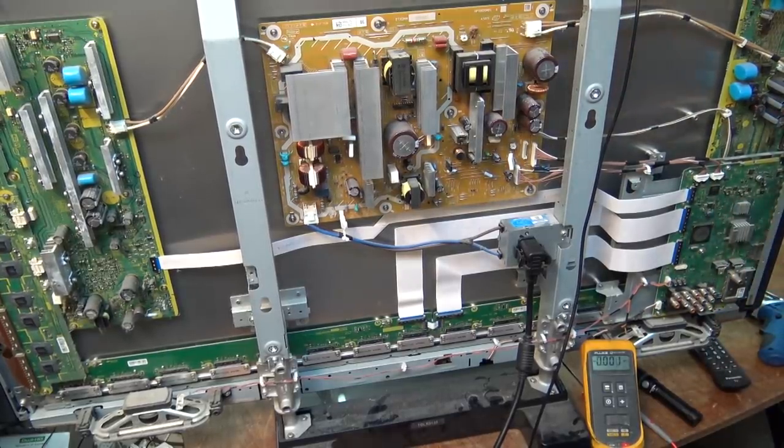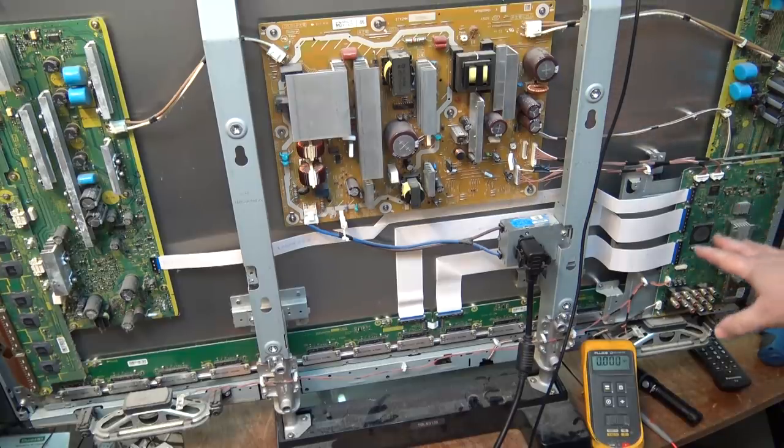With this wire connected it goes into immediate shutdown - it doesn't even start. As soon as it attempts to start it goes into over-current shutdown. This resistor is a current sense loop - if there's too much current drawn on pin number three from connector P6, it will trigger a transistor off the current sensing resistor which will immediately shut the power supply down to protect it. We've removed the load and now the power supply is no longer shutting down. So now we're chasing something on the A board.